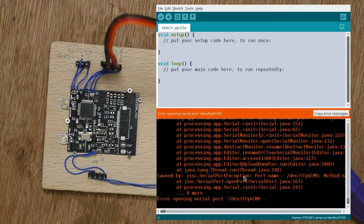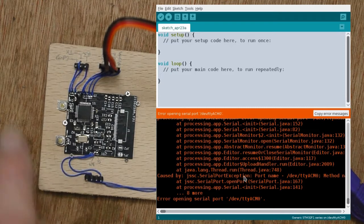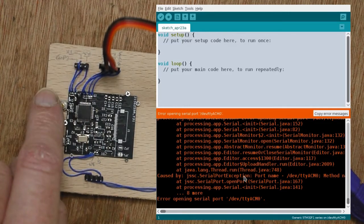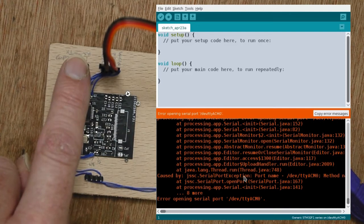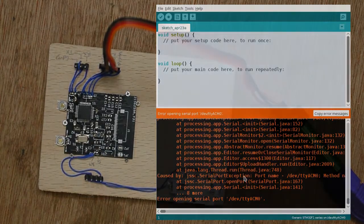So we could do some basic checkup of stuff that's going on, but in order to do that I need some sort of output, and I don't have a display at the moment, and there's quite a lot of code needed to get that display to work. So the best option is probably to get the RS-232 working. So I'll dig around and find one of my serial to USB connectors or adapters, and I'll attach that there, and we'll get the serial debug working as well, because that will be useful when I'm developing stuff in here.